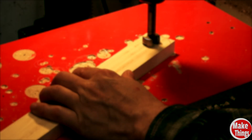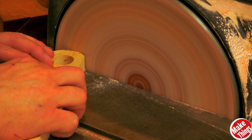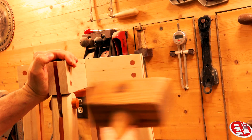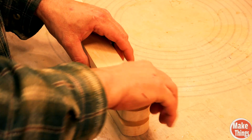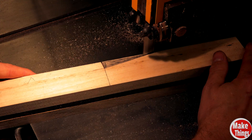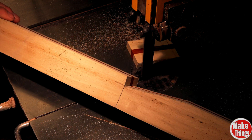The advanced leg version uses three layers, like the base. At the end of each leg is a hole that will connect to the hooks of the chair top. Once they're lined up, you'll use a 1-inch dowel for each joint. Gluing the legs together is similar to the base glue-up, except we'll use a dowel to make sure both sides of the legs line up correctly. Mapping out the cut lines for this is easy. The legs were then notched out with the bandsaw. Afterwards, I drilled holes in the side of the legs for the cross brace.